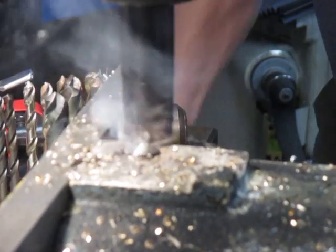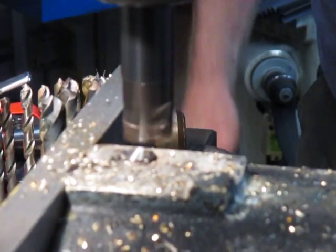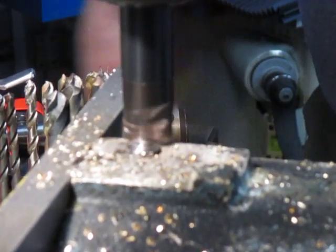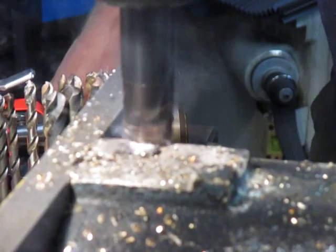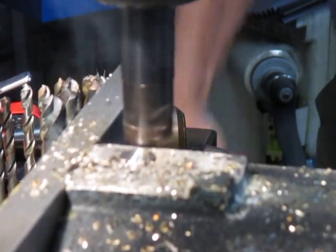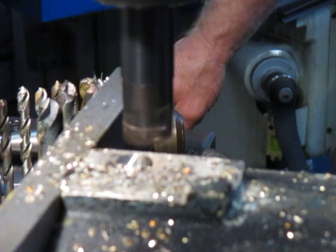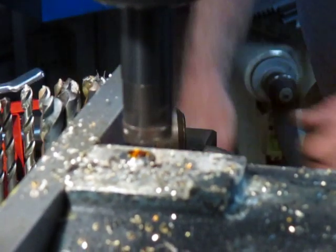quite often the bolt will be bent a little bit, and so if you get the centre of the bolt when it's protruding out, it's not necessarily the centre of the bolt that you want to get to. And the whole trick was, one of the tricks with the getter out, as I've said on many occasions, is to get in the guts. If you're in the centre, you're halfway home.